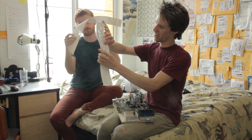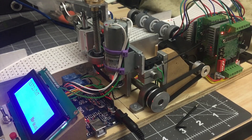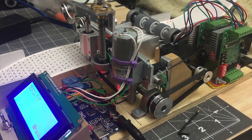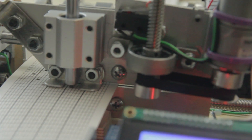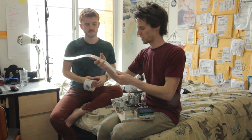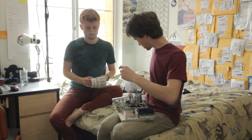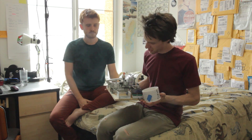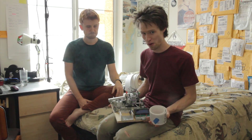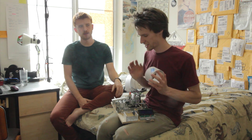So far we've printed out a bunch of test songs. These are some of the originals with giant holes spanning two notes, and giant misaligned holes. This is a big calibration sheet — we were testing carriage drift. It turned out that with hard stops and starts the stepper motor for the carriage was skipping steps sometimes, and the solution was to make it accelerate slowly instead of stopping and starting hard. But once we got it working we were able to print a few songs. We've punched about six or seven meters of paper so far, and the machine seems pretty solid.